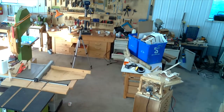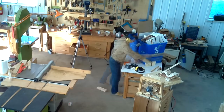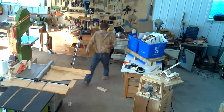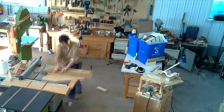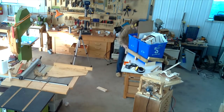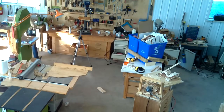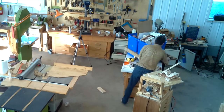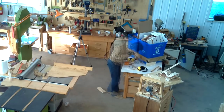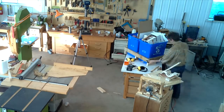Jigging up for where the frame is gonna go — it's gonna go about 3.5 inches off the bottom — so I had to put that on supports and then work out how long the longer pieces need to be and cut those to length. Then I clamped together one end of my frame so I could screw it without having to worry about the pieces shifting on me. I'm just screwing those with a drill. I don't like using impact drivers — they're too noisy.